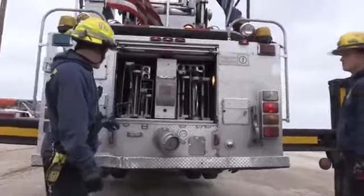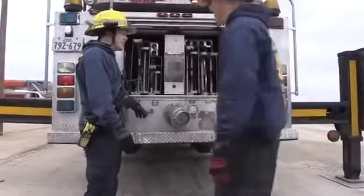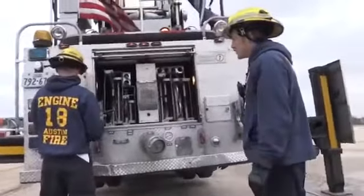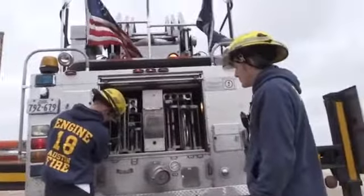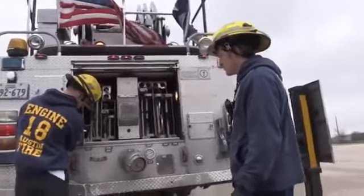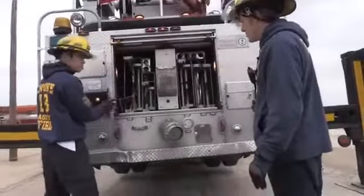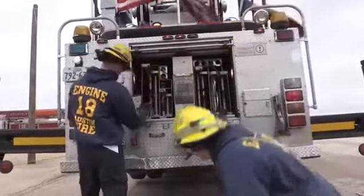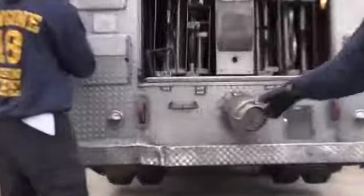So now we've got it. Let's go ahead and touch it up, Tim. Yeah, just touch up a little bit. Let's get that right to 0. So you just want to drop that side just a little bit. A little bit more. There you go. All right, so he's right on the 0. His tires are still looking great. So now we're ready to pin the stabilizers, okay? So let's go look at one of the pins real quick.